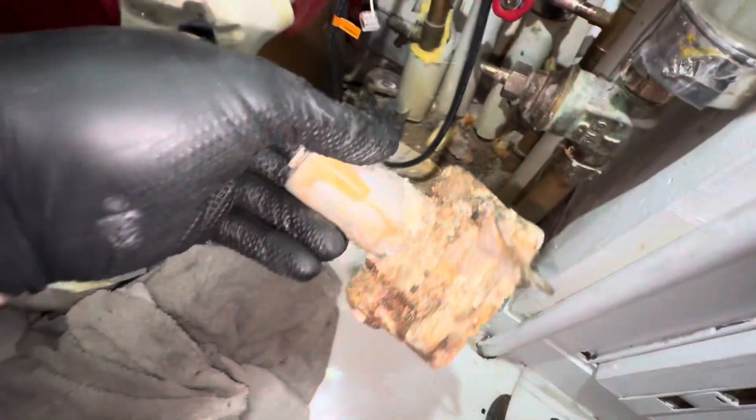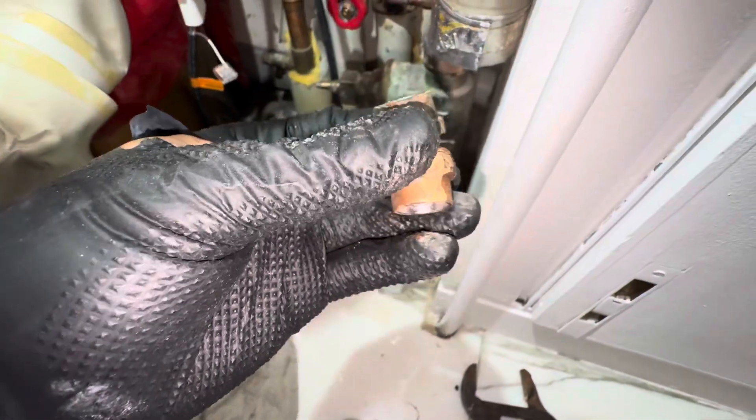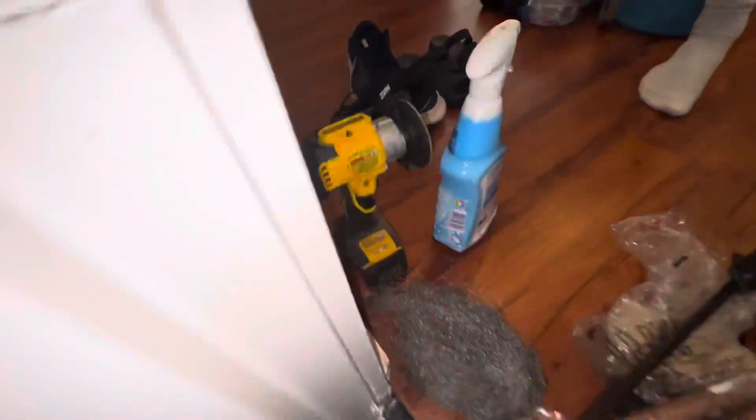New gate valve all in there, replacing the old one. There's a bit to cut out — that grinder is an absolute lifesaver, really useful. I'm not going to lie with that one — couldn't see the wood for the trees. I was actually going to re-pipe the whole lot, the 28mm, then on the other side from the zone valve. I spoke to Jack of GB Maintenance and he said, why don't you just cut the valve and sweat it off? Made life ten times easier — thanks, Jack.